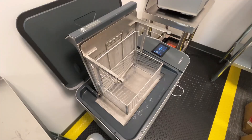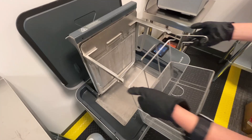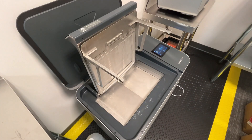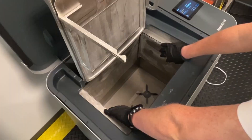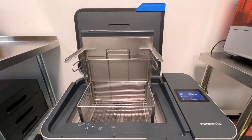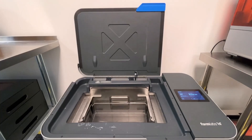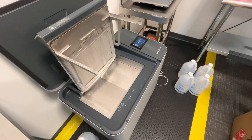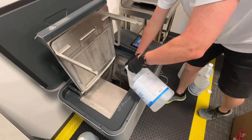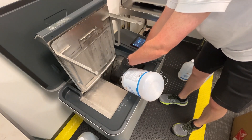We did a final wipe down on the Wash L's upper surfaces since resin can pool here. Once all that was completed, you are now ready to add fresh solvent. There are a couple of ways to add solvent. I opted for simply removing the wash basket and holding one of the door flaps ajar. You can see we already have about two gallons in the bottom that was briefly added for a quick wash on a part needed for a trade show. The other method is to submerge the carriage and wash basket assembly using the lower button on the screen, which will keep the doors open and is probably the easier method. Since the Wash L has a maximum capacity of about 11 gallons, you should aim to purchase 12 gallons of solvent — it helps to have a little extra for the squirt bottle. Now it's just a matter of pouring it all in.